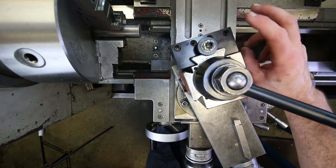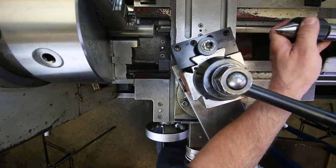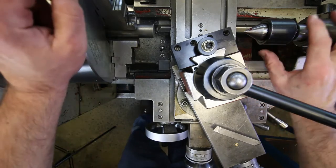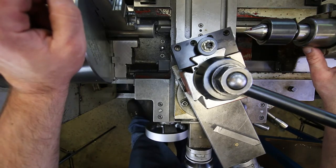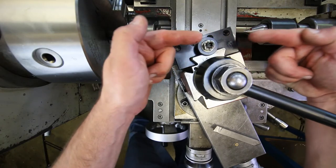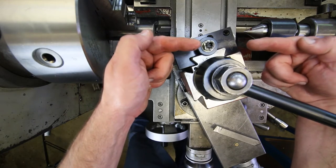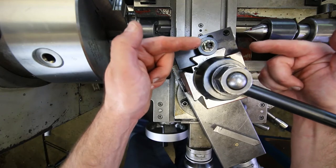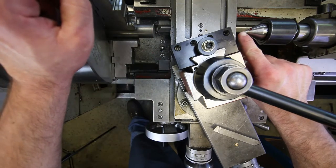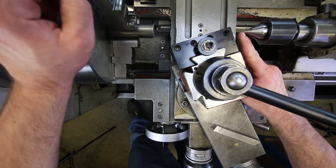You can do a sensitive test by taking a cut and seeing whether a nub forms at center. What I use is a live center — put it right up into the tail stock. If the tail stock is correctly manufactured and in good alignment, the tip of that live center should be right on the center of the spindle axis. Then just adjust the tool up and down so the tool tip meets the center tip.